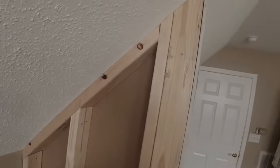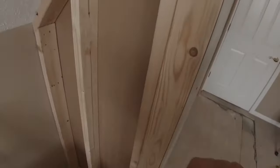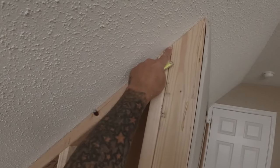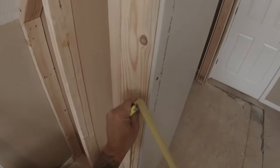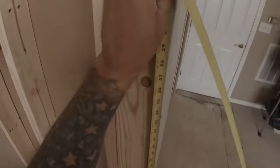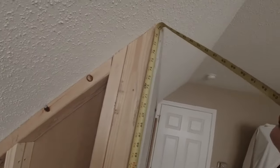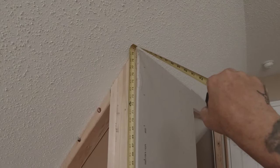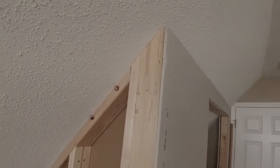And that's the sheetrock. Well, wait a minute. What happened here is I measured to here, that's 76. I need to come way out here. I would've cut that sheetrock wrong. I would've made it 76, because I'm thinking of the inside. Okay, so we got 79 and a half. See how I'm taking a quarter off of it? 79 and a half.